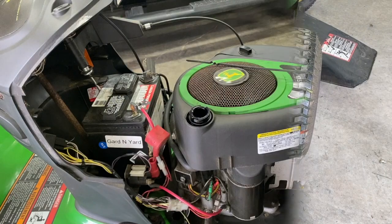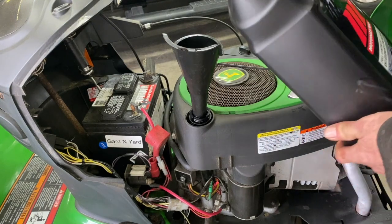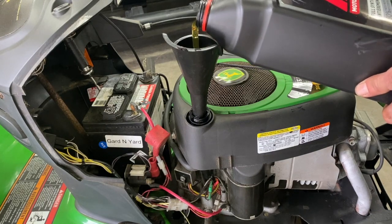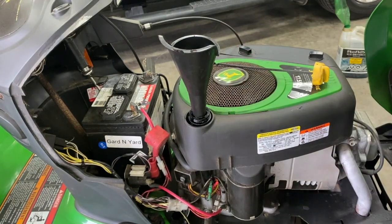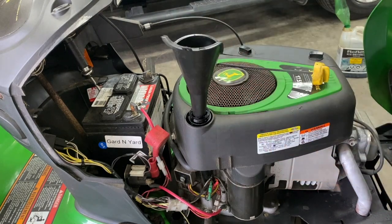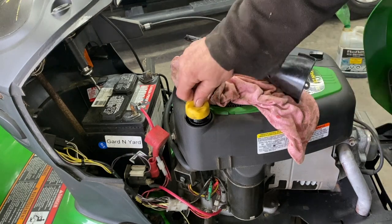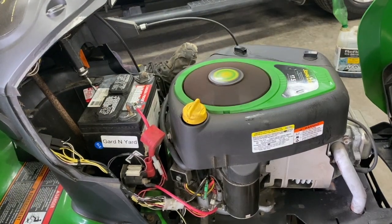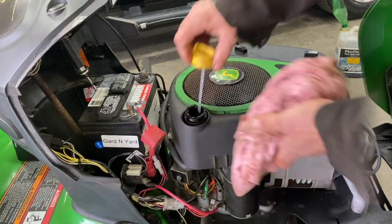Move your tractor. Check your filler here, make sure it's clean — it is. I already drained the oil out of this motor, so I'm going to fill it with oil nice and easy, try not to make a mess. I'm going to gauge it here — put about a liter and a half, or a quart and a half. It's right just past the full mark, which is perfect because the filter is not full yet. Start it out and check it one more time.